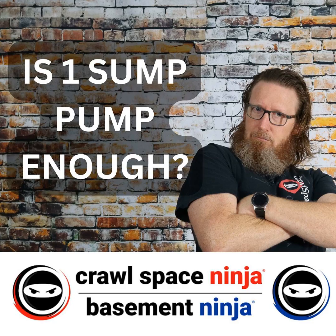Now, the sump pump should always be installed immediately if you're doing this yourself. Go ahead and get the sump pump installed — give that standing water somewhere to go. But then eventually you want to dig a full perimeter trench around the entire perimeter of the crawl space. If it's got a lot of square footage, you may even cross-connect through the center of the crawl space to the outside, especially if you've got water percolating up, to get that water to the sump pump as quickly as possible.